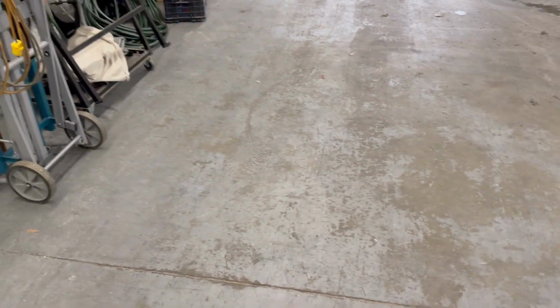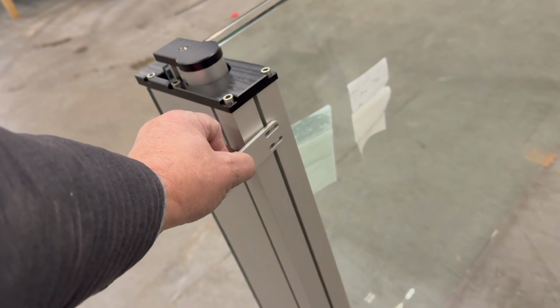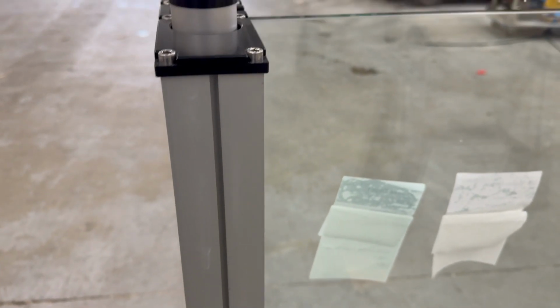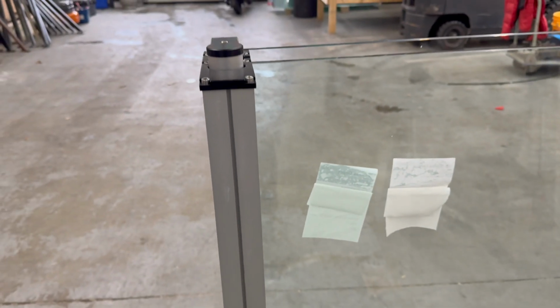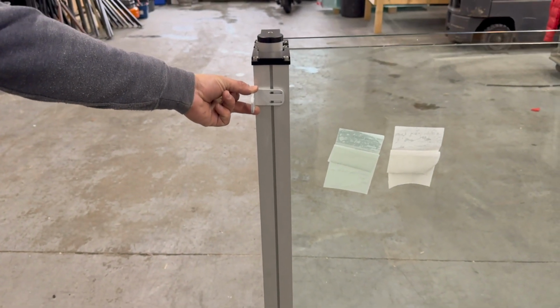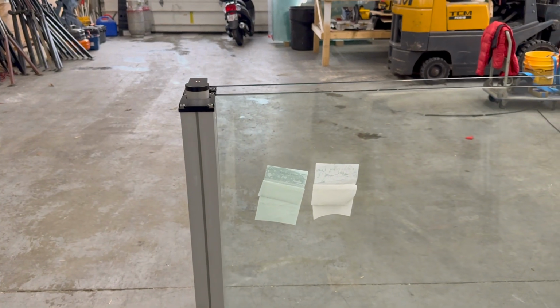And the only other thing to be aware of is if you have 2 panels side by side, you can use a little joiner to join them. There are screws already in the groove at the bottom. You just have to slide them up and then screw them to each other. And there's also one for a corner. So if you need to do a corner, you can brace it. You don't really need those. It just does add a huge amount of extra strength if you need it.